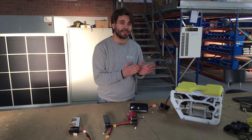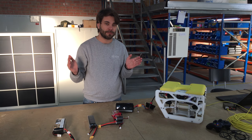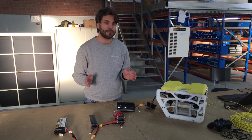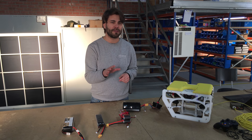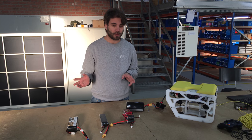The way the Seaview Nano is designed, it can take a relatively wide range of different types of batteries. We normally use LiPo batteries and it can take both 3S and 4S batteries. 3S are normally around 11 volts and 4S batteries are normally around 14-15 volts.